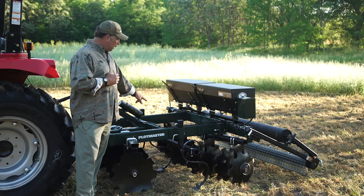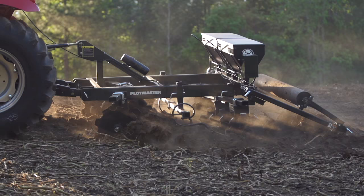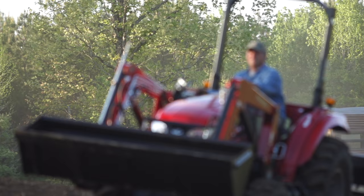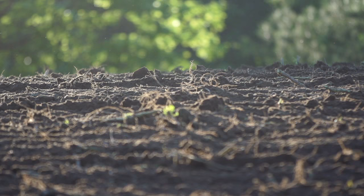It's got a plow system here in between the discs. What we've done is when you drop those plows in the ground, they pull that unit into the ground — we're using the down pressure of those plows to pull our unit in the ground and keep it there. That's very important especially when you're trying to do tillage on heavy or compacted soils.